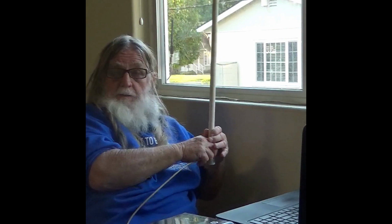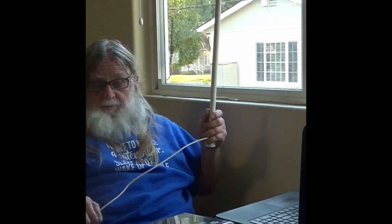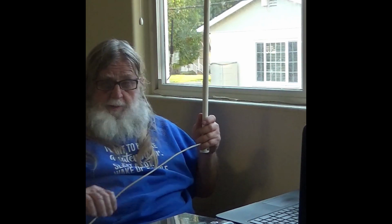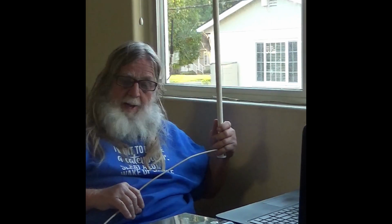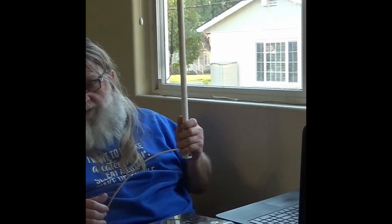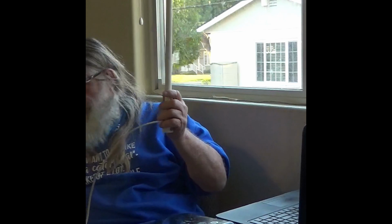And on my boat, I used to have these things running all over my fly bridge up to the top. Then I realized that the cable length is kind of a problem. You lose signal strength the longer the cable is, so then I'd move the cable back and I'd put in shorter lengths and try to increase my signal by decreasing the cable length. So that's one thing you have to consider if you're going to use this system, but we may not use this system.